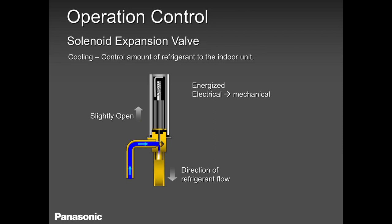Okay, guys, this call is when the compressor is running at a very low frequency and when the load is very low, it hardly moves. But when there is more call, let's say you set the temperature very, very low in cooling. Now it's opening more, and now it's at max. And when it's at max, just watch the flow of refrigerant. It's flowing like crazy.